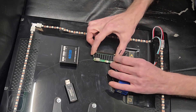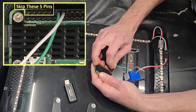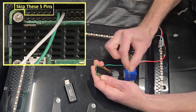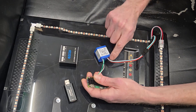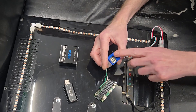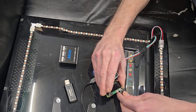We're trying to find a nice way to lay everything out so it's neat behind the wall mount bracket. On the Raspberry Pi, if you're holding it with the pin header up and to your right — on the 0W, the SD card is on this side — on your right you're going to count one, two, three, four, five, and on the sixth pin put our green wire. The very next pin on the far right is our ground wire. That provides the data to the level shifter, which then steps it up to five volts to drive the LED strip. My level shifter also comes with two Type-A USB ports to power the Raspberry Pi, with your choice of Micro or Type-C connector.